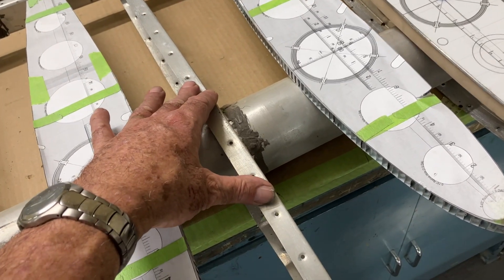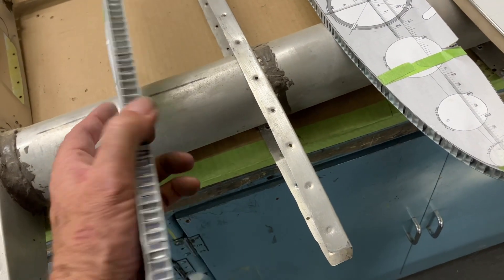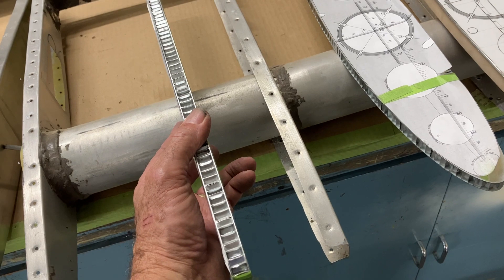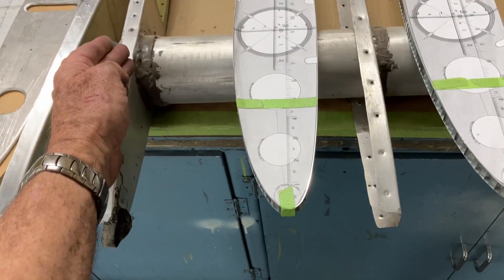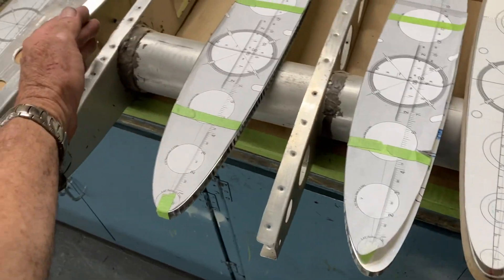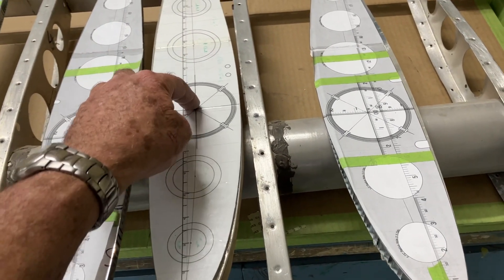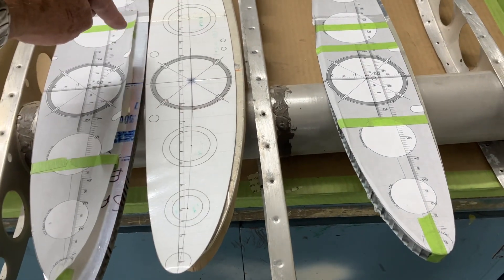We come along to wing ribs three and four — this one here is surplus to my needs because I'm actually going to put in two honeycomb ribs. Here's my honeycomb ready to go at seven inches, so I'll take out the middle one and put each of these at seven inches. Instead of being 10.5 inches from there to there, it will be seven inches between each, and the existing rib continues. So we've got one and two, three and four disappears. I've got the formers here to make up five and six, similar to one and two, rubber pressing the area forward of the spar.